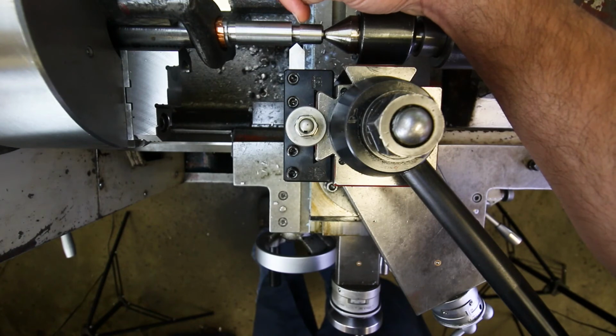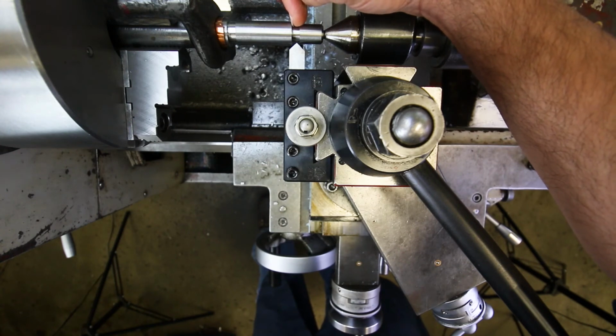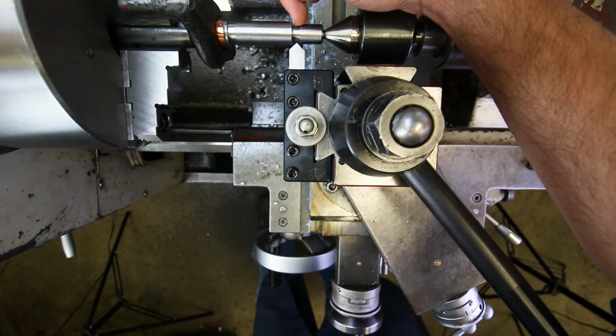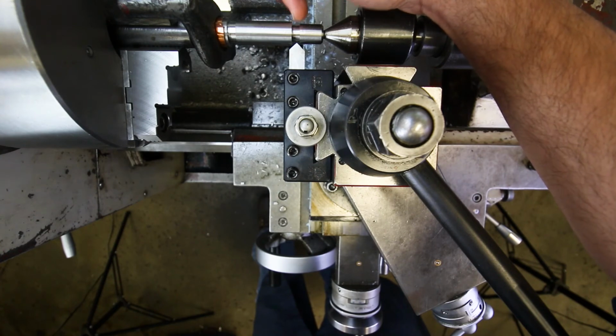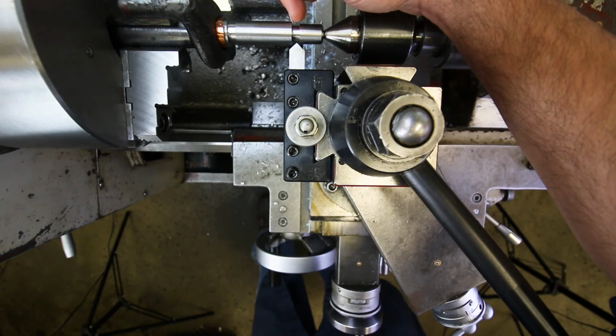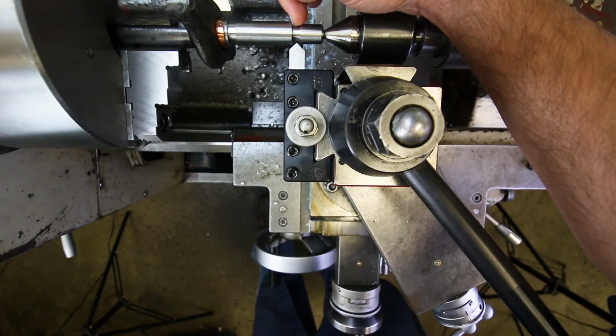Problem is that if you just try to do that by eye, right, then you're very likely to either not go far enough or to go too far, and then you'll cut a little groove with the end of your chamfer, a little sharp pointed 45-degree or 90-degree groove into your nice square groove that you just spent all that time putting in there, right? And it's going to totally mess that up. So how do we get close enough without getting too close?